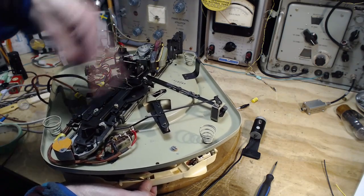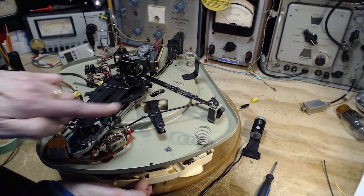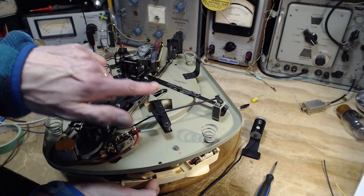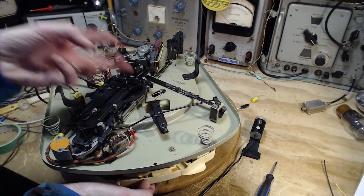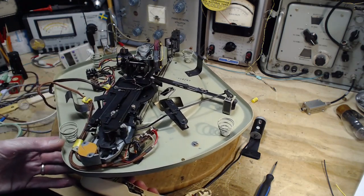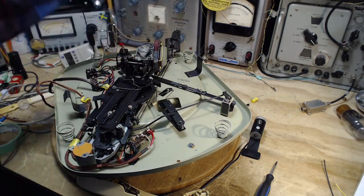It's kicking it back each time around enough that this, I don't know what to call it, engager up here won't engage. Never gets moved far enough to engage something. But if you move the tone arm fast enough, this will move fast enough to get far enough in before the record comes around again and kicks it out, that it'll engage with the mechanism. So there's a kicker kicking it out. And when it moves in slowly, it keeps getting kicked away. But if it moves in quick enough, it gets in there, hits the mechanism, and triggers the return of the tone arm. Velocity sensor. Many of them, a little different style of record players, have different styles.